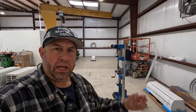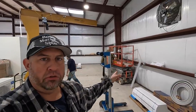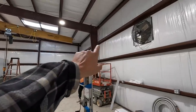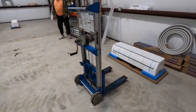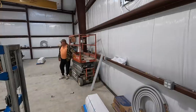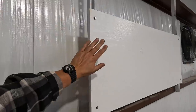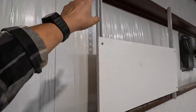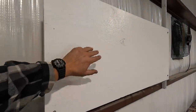So it's the next day. We got Fernando here, his helper Billy, and we're going to get started on the install. I've still got Joe's lift, so I'm going to use that. We're going to get up here and start getting our uni strut mounted to the wall. Fernando brought his little genie lift here that we can use to pick the air handlers up and get them mounted to the plywood. We got our first board up — we got our uni strut bolted to the two girders, and then of course our plywood bolted to the uni strut, so the air handler will mount right here.